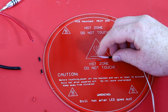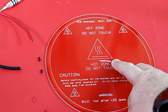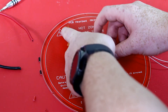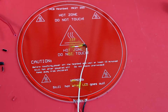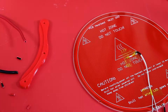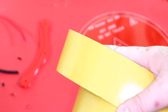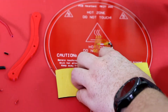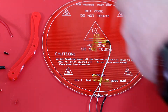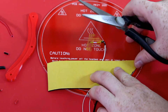Next we're going to go ahead and add our thermostat. The bulb of the thermostat should fit directly in the center, and I'm going to use Kapton tape to hold it in place. This is how it looks after I'm done. Next I'm going to use pipe insulator tape to insulate the bed. You want to be careful with this because once you stick it to the bed it's very hard to get off, so make sure you have your cuts right before you put it down, otherwise you're going to have a bad day.